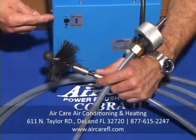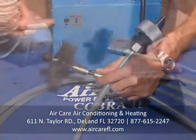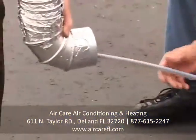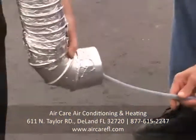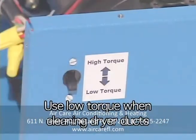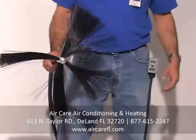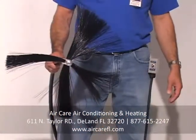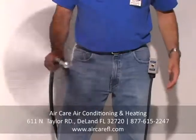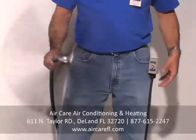For dryer ducts, a special 4-inch brush and nest claw are available with a special small diameter cable to make the tight 90-degree turns found in many dryer exhaust ducts. To prevent damage to the cable, make sure that the torque adjusting switch is in the low torque position when using this smaller cable. The remote control is on a 15-foot cable with forward, stop, and reverse functions.